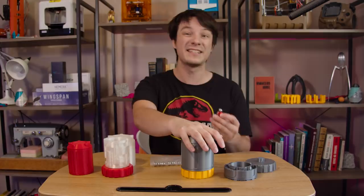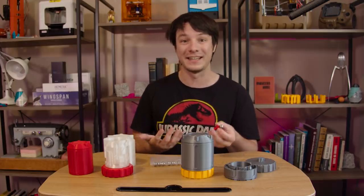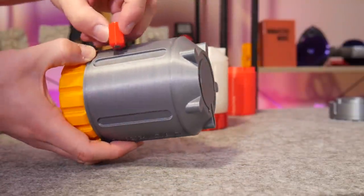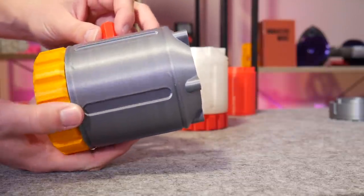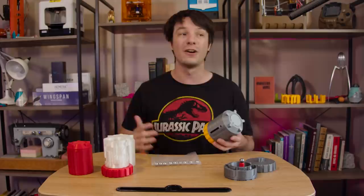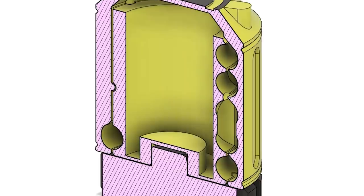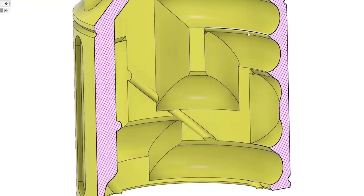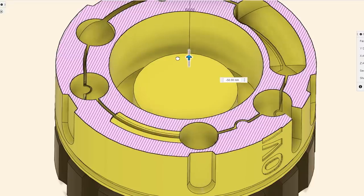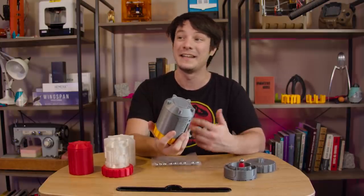What I suggest if you want to use this puzzle as part of a treasure hunt is to hide the key elsewhere with clues to its location, which will make the solving a bit easier. It's actually quite nerve-wracking fishing for the steel ball within the puzzle and manipulating it to try to guide it through the unseen path. Designing this model really pushed my knowledge of designing interacting 3D printed objects which can be reproduced reliably on affordable machines — I use the Creality Ender 3. Because there's only a tiny gap between the two objects, I've designed in heaps of tiny details such as small chamfers to cut away overhangs, and careful consideration of wall thickness throughout the build where the 3D maze comes quite close to the outer wall. It should go without saying, but this model is designed to print without support material, unless you want a truly impossible puzzle.